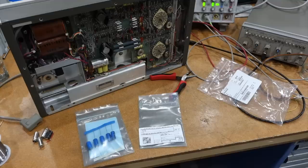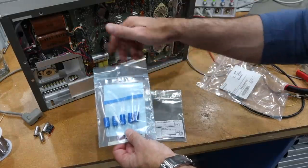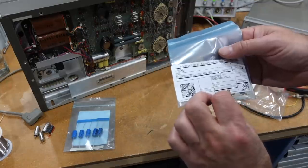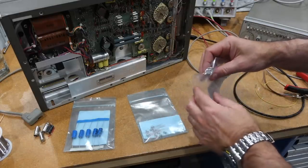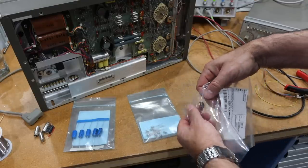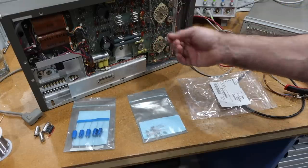Much, much later. Okay, let's see if we can climb out of our hole thanks to a new part. So I've received the correct capacitors. I replaced all of them. The neon bulbs, A1C, that's still made. I had trouble with the photo resistor, and it looked good, but it's not the right diameter, and it's way too big. And I have a 9mm one coming from eBay, but I can't guarantee that it will be the right wavelength. A few minutes later.